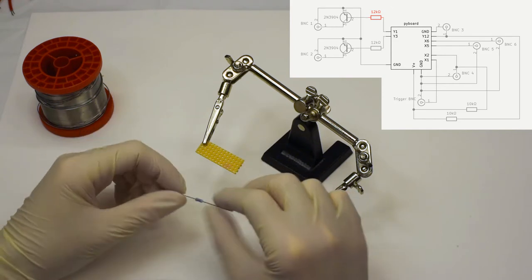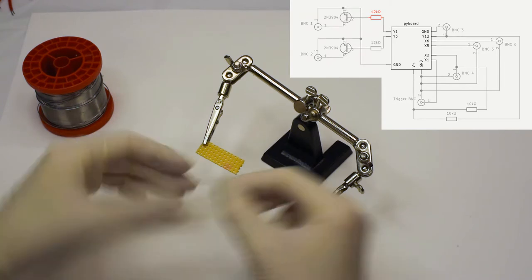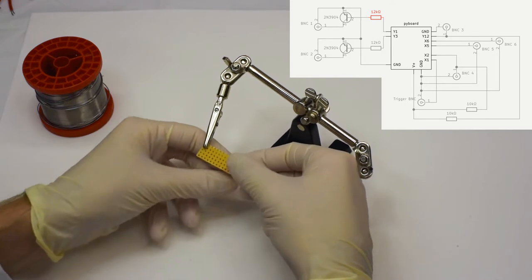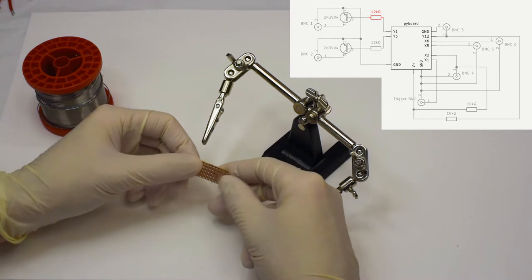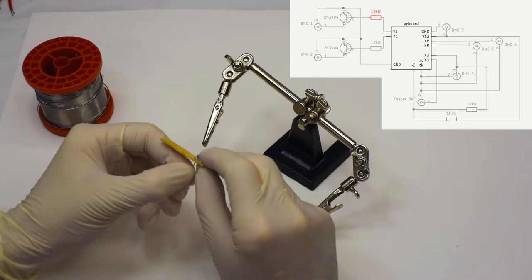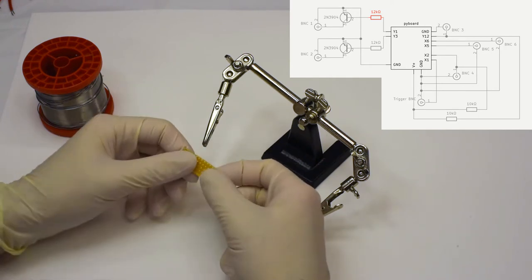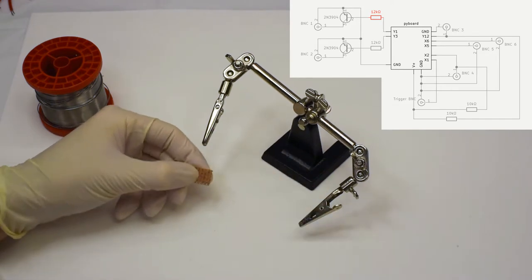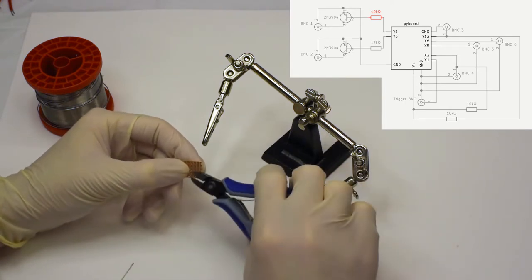This will be a resistor, which we can squeeze in by bending its legs and threading it through the holes where it has to go in the strip board, and then pulling it tight. In order for us to be able to film this, we're going to turn the strip board upside down, and so that the resistor doesn't fall out, we are going to bend its legs outward. We will do this with a number of components. It's not necessary if you do it yourself and you don't intend to film, but it aids us in keeping everything in place. The legs can be cut off at the beginning or at the end of the procedure so as to not get in the way.